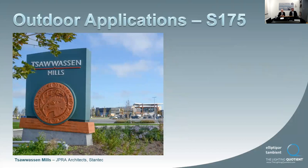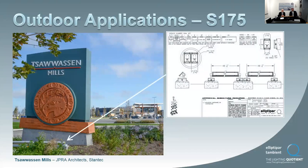Another example of signage lighting, more in a landscape type setting. Unfortunately, we don't have a nighttime shot to correspond to this, but this is a shopping center out in British Columbia where they had several of these side elements, some much larger, some smaller, some actually sweeping over longer arc length and bending or curving. So they came up with the thought of, rather than mounting rows where you would tend to share a hub, to allow them to deal with some of these that might not be just flat or straight, they used a consistent detail where any sign requiring more than a single fixture used all separate mounting with 2 J boxes landing on the same concrete pad, and that gave them the play to adjust the exact angle of the fixtures.